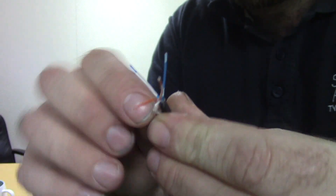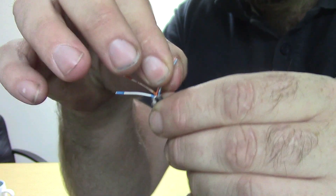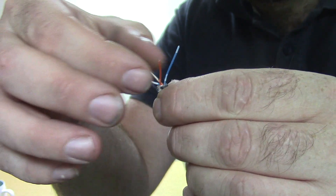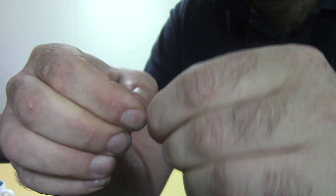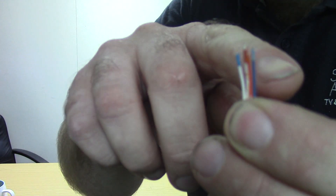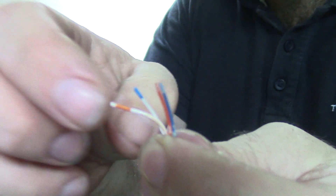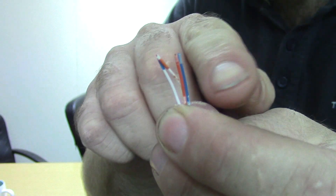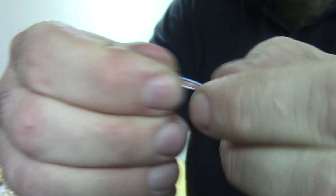But to do all telephone connections, it should be done in this way: blue on pin two, orange on pin three, white and orange on pin four, and white and blue on pin five. There's actually a green pair not present here — this is a three-pair cable. The way I remember is blue on two, then the solid colours go that end, and it's the outside pairs working in. So you would have green and white-green at the outside, then work inwards.